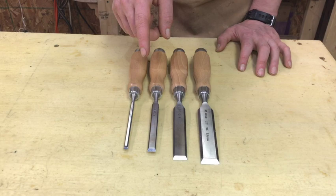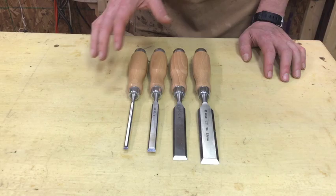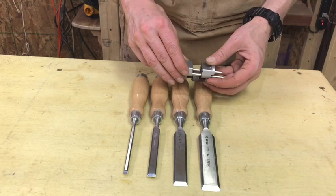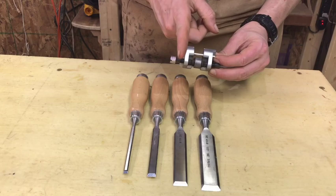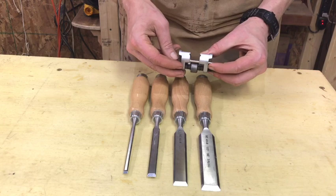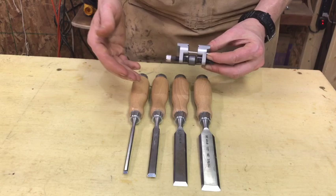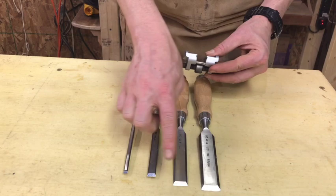Just be careful — when you get these really sharp they can cut you. I dropped one, instinctively reached for it, and had to get about six stitches in my hand. As I mentioned, I use one of these cheap honing guides and they all look identical no matter who sells them. There's a lot of play on the wheel — not just side to side but at an angle as well — and this can lead to an angled sharpening, which mine unfortunately have. It's never been a problem when using them, but if I have the money I'm going to get a nicer Veritas or similar with a longer bar. Of course the ideal is hand sharpening but I don't sharpen enough to pick up the skill. These guides will get you a sharp chisel but the quality is very hit or miss on whether you keep it at 90 degrees.